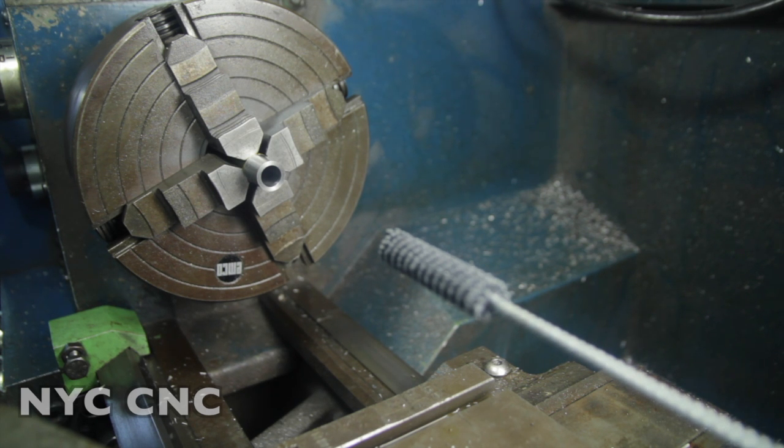We'll want to use a lubricant, so we're going to use some 30 weight motor oil. And then the directions say to make sure you've got the tool rotating upon entry and removal from the hole, and the recommended RPM range is 500 to 1200. And clean the cylinder after with warm water and a detergent, and then oil the cylinder. I think that's it. So let's give this a shot.